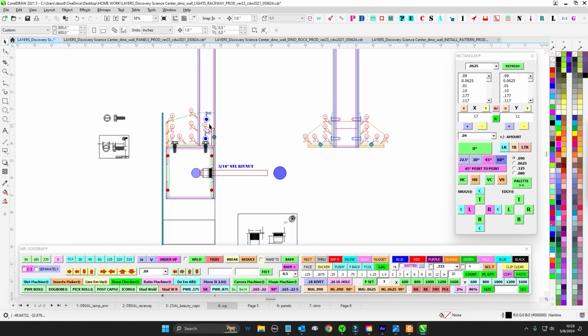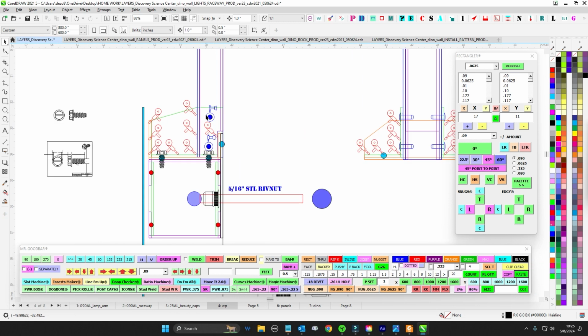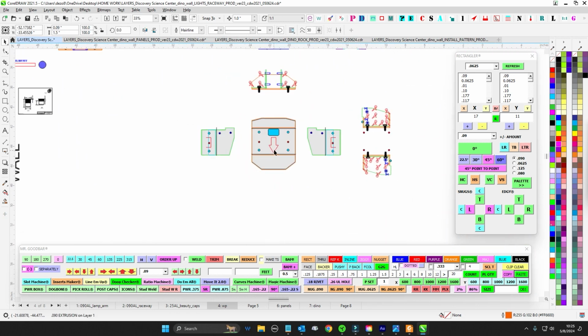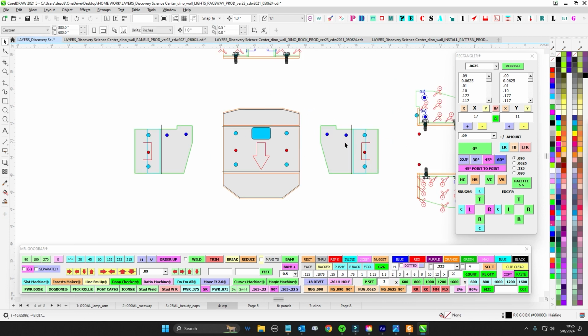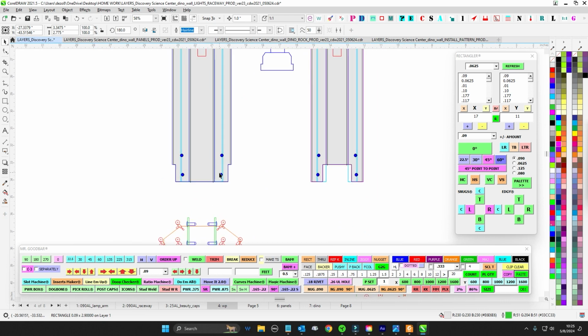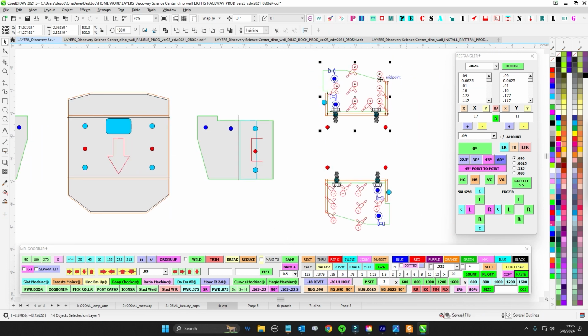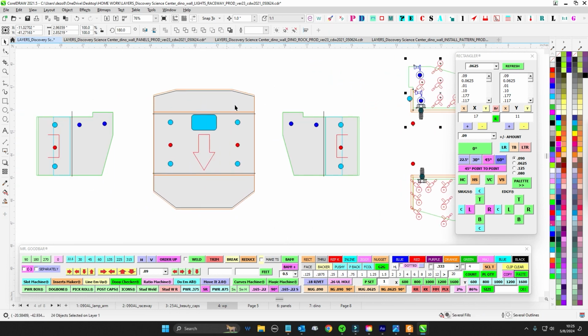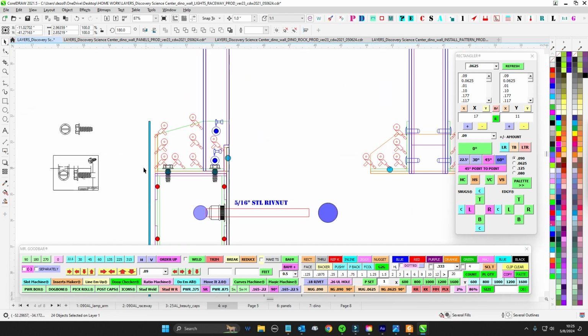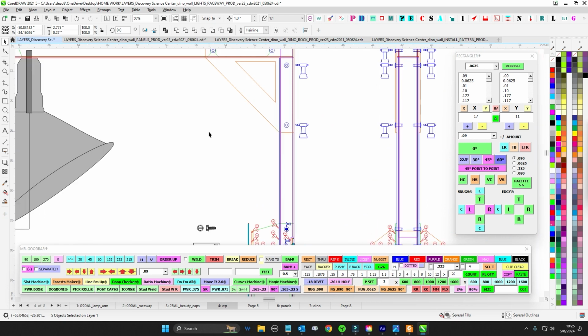Then you're going to tack this whole thing together to hold it, make sure it's nice and strong. Otherwise, it's going to be kind of flexy. And actually, this bottom plate won't attach to anything unless you tack it to these two guys. So cleco it together, rivet it together. And then while it's clecoed, you're just going to go ahead and burn the orange guy here to the green guy here on both sides and make it nice and strong. That way it's going to be nice and sandwiched. So we get almost a 3/16 base plate right here to hold all of this up.